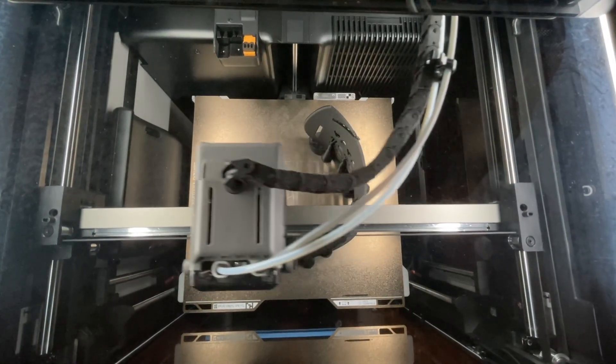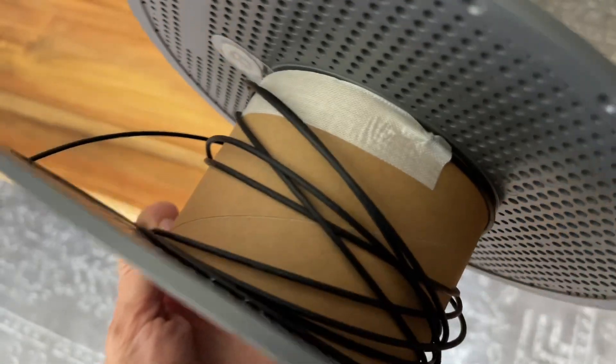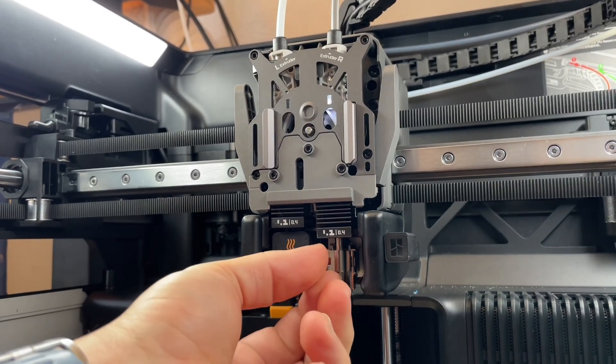High performance — the machine is flawless. We've had maybe a clog, which happens for us a lot of the time when you come to the end of one roll, where some of the glue or piece of tape comes through the nozzle with the filament. Low maintenance, parts are fairly cheap, and a big improvement over the X1C and P1S is the nozzle — much more like the A1, you can just unclip and remove it, swap between 0.4 and 0.6mm, so it's really easy to change versus having to unplug everything. So is it worth the hype? Yes.